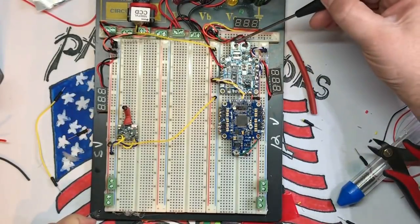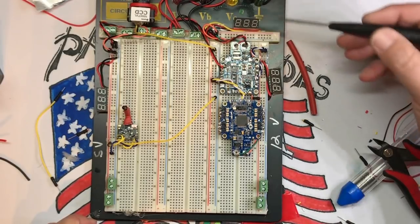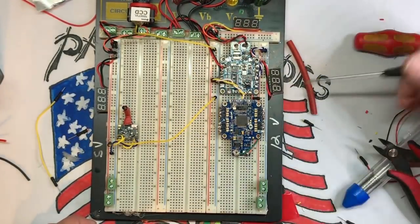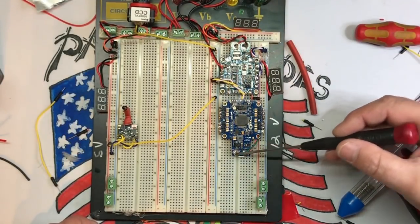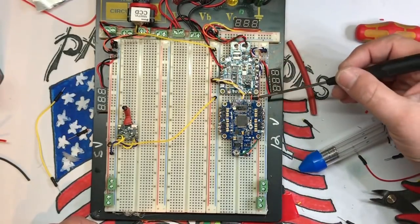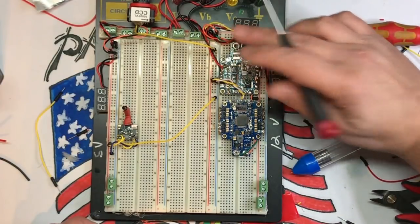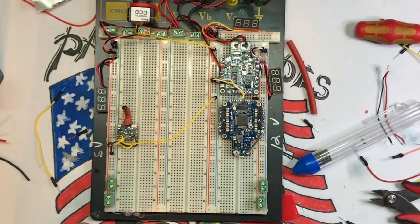So I put two into the power lead, positive and negative. So the top bar is positive, bottom bar is negative. And I did the same thing with the flight controller. Everything on here is mounted with double-sided tape. For vibration, no. But so positive and negative. And this guy, I ran these two positive and negative all the way up under these boards. I put this little pin in here just to kind of keep it neat. There's nothing going to that. It's just holding the wires in and it goes up and it plugs into here as well. And then we've also got our meter plugged in. Then we've also got all of these free and not to mention all of these. So we have tons of power there.